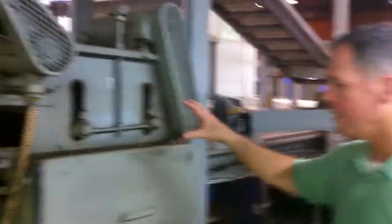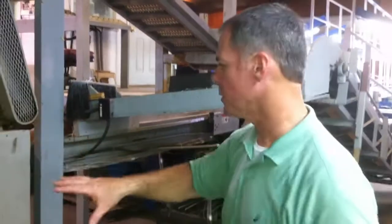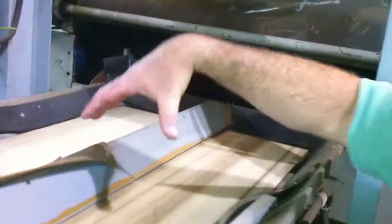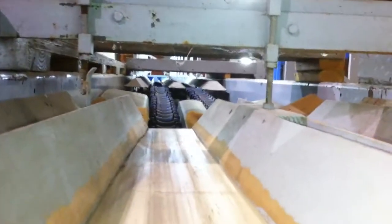Once the fruit left the washer — the brush box if you will — it entered this hot fruit wax machine, which is a hot wax for fruits and vegetables. As it left the wax machine, it entered the singulator. The fruit would get onto the singulator and end up in a single-file line by the time it reached the carriers or cups on the sorter — we call them the carriers or cups.